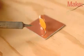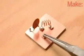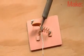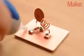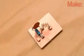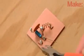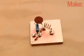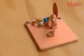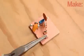Begin with a 0.01 microfarad capacitor. Then another pad, the 27 kiloohm resistor, the 4th pad, the electrolytic capacitor. Remember that electrolytic capacitors are polarized, so make sure you've got this one turned the right way. A 10 kiloohm resistor, and another 0.01 capacitor. And then the final pad.